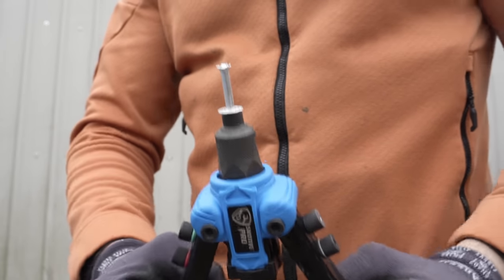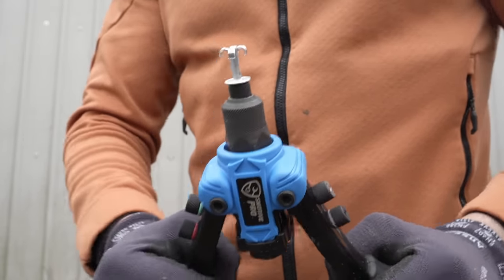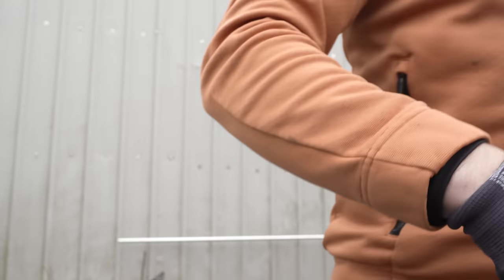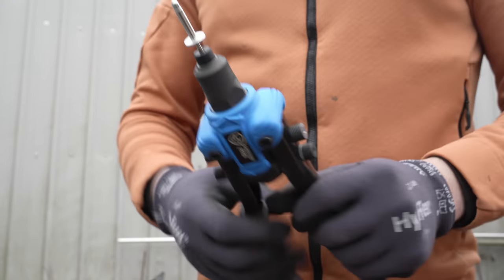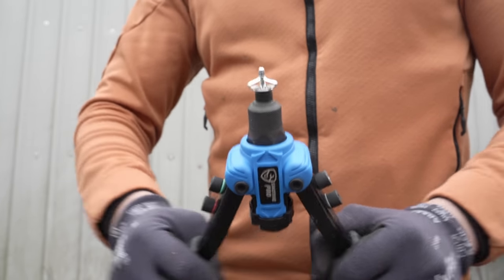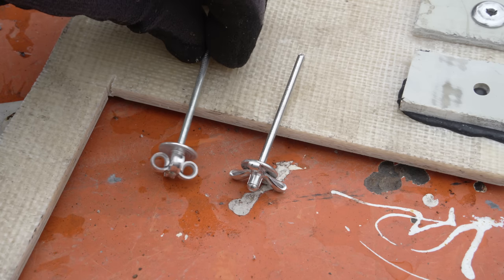I'm trying two types of wide pressure blind pop rivets, and both, due to the shapes needed to be achieved, are aluminium. I did try to find steel, but presumably it wouldn't deform enough with the limited force of a hand riveter. The first variety peels back into four curls, and the other splays out with three legs. And here they're not set into anything, so you can see the difference more clearly.